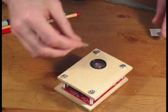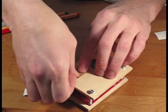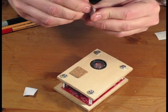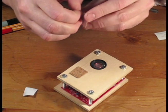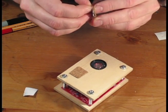We'll need a spot to place the pins when we hold on our specimen. For this, we're going to use the cork stickers. Peel off the backing and adhere it to the top of the SpikerBox. You will want to place it on the right-hand side so that it's close to the RCA connector. A single sticker of cork is not thick enough to hold our pins. Therefore, we've added 2 stickers so you can place them on top of each other.